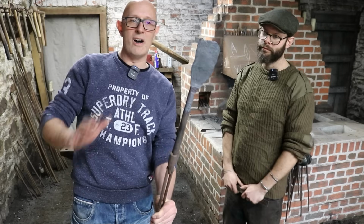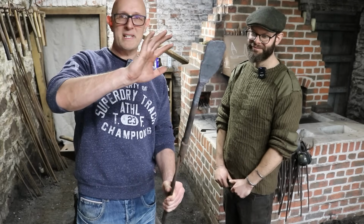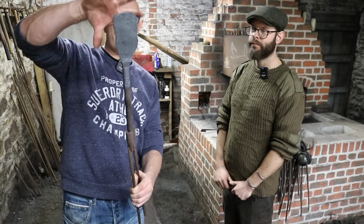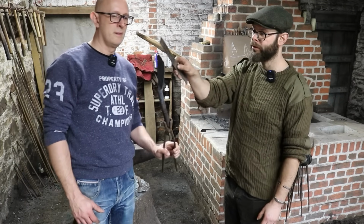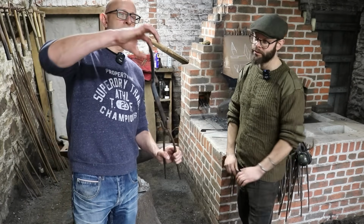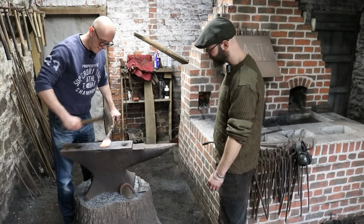Incidentally, if you're wondering, this looks dark on screen, but the heat radiating from this, you could definitely iron your shirt with that. Be a bit messy, but yeah, it's amazing, isn't it? So, right, let's try and get that final shape. We're getting relatively close now, to start thinking about making it look good. So all of that thickness there wants to be pushed into the corners. And all of these wobbly edges, you want to just start pulling material into those dips. Very quickly that will look quite nice. At the edges we're at about 1.5 millimetres now, and you can see we started from that bar there. We're now down to about the thickness of the end of a sword blade up here. And then dragging to the edges if you can.